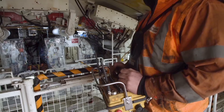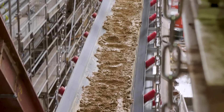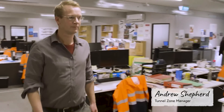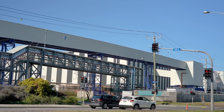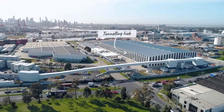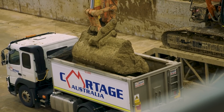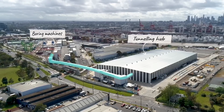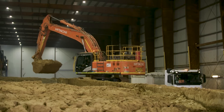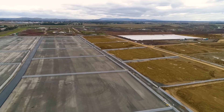The tunnelling will require the removal of 1.5 million cubic metres of rock and soil. Andrew guides us through how this is managed. Excavated rock and soil is moved via a conveyor system to our purpose-built tunnelling hub. The rock and soil we excavate is mixed with substances to form a paste so it can be easily transported from our tunnel boring machines to the hub. From massive bins within the shed, the soil is loaded into trucks to be taken away and safely disposed of at a purpose-built facility in Bulla.